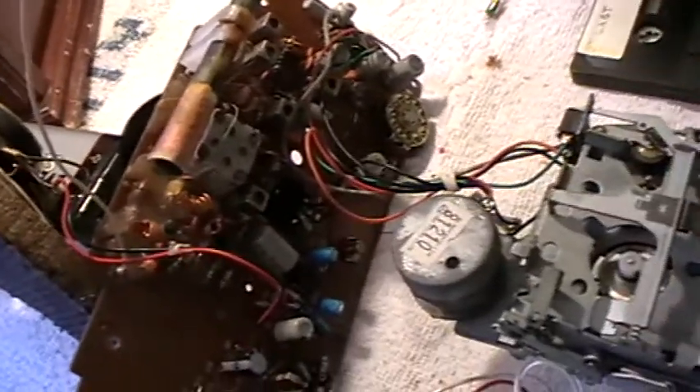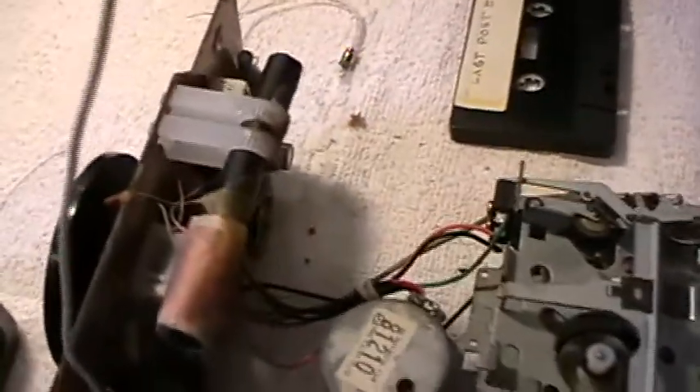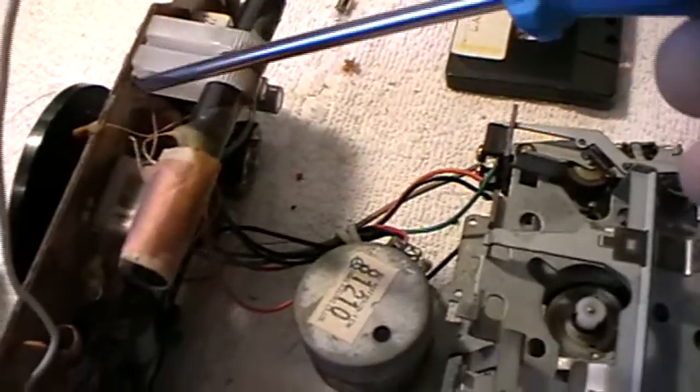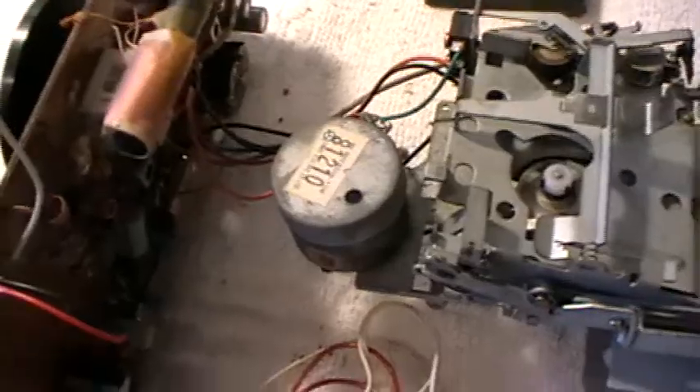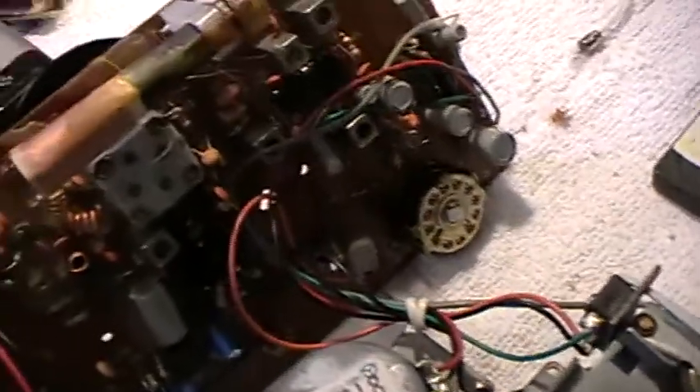They used as little solder as possible and an amazing amount of glue — it's just a splodge of glue holding all the components and capacitors in there. The front panel, the wavelength indicator, had fallen off — it was only held on by double-sided sellotape. The ferrite rod aerial was completely broken away, damaged when it was thrown in the skip. A lot of the contacts for the variable capacitor for getting the wavelength had all fallen off, so I've had to solder those back on.